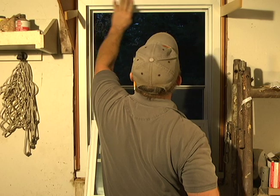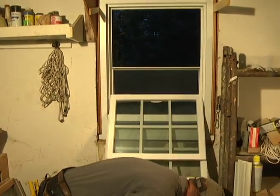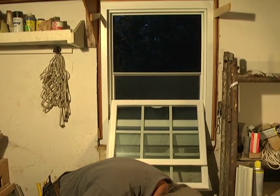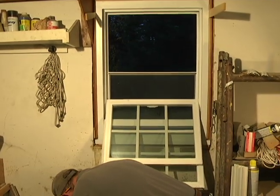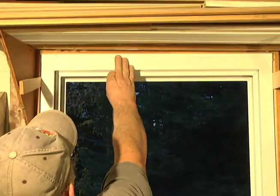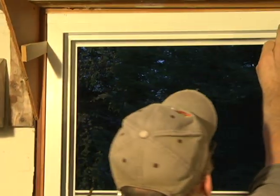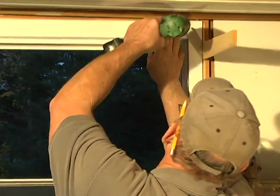I'm happy with that. Now, before we put the screw gun away, I've got 2 more screws to show you. Maybe one, because I might have lost the other one. Well, I'll show you one for now, and I'll find the other one later. This is the sill expander I told you about with the insulation in it. We're pretty tight up there, but if there's any gap, you want to lift it up. This side seems to have a little gap in it. What you do is you lift it up tight, keep the screws to the corners, don't lose it.